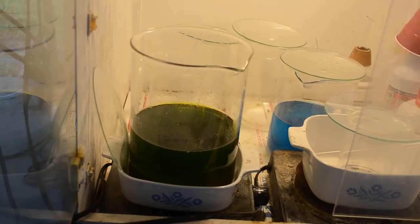So yeah, see, that's one way I can always tell whether the gold's fully dissolved or not, if there's nitric acid left over in the solution. But if there's no nitric left, then I've got to worry there might be some gold left in there. So let me decant this stuff off.